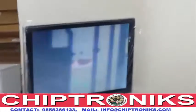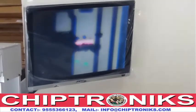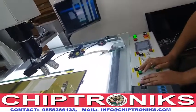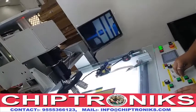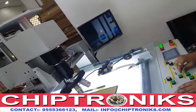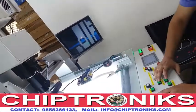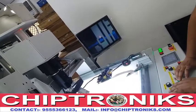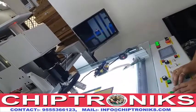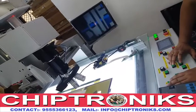This line has been cut completely. Now I am going to use the laser energy to cut the track, and then I will solder the track to the working data column. We will reduce the size of the laser and solder it. This laser machine is used for cutting and soldering these ITO tracks, but which track to choose is all about training and experience. Different brands need different tracks to connect — sometimes you have to cut the Y driver, sometimes the X driver, and that totally depends on training.